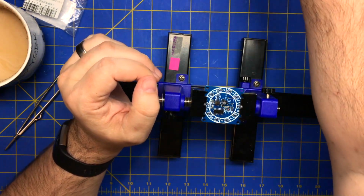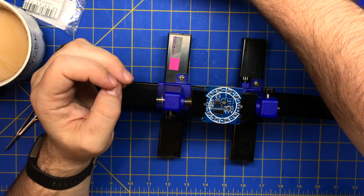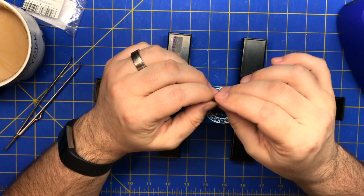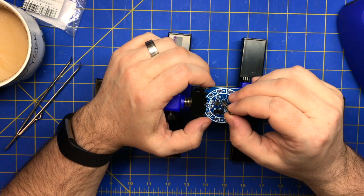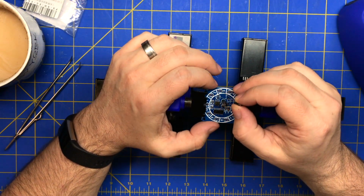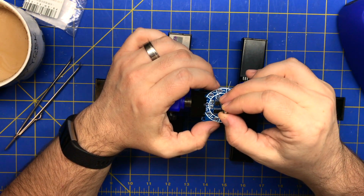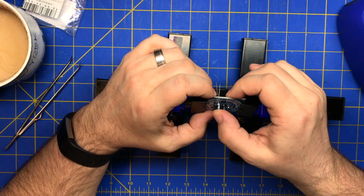Oh, that's not a capacitor. Where did the other capacitor go? There it is. This is a 1 microfarad. Again, short leg, negative, positive on the silk screen. Usually it'll say positive, or one side will be shaded. That's the band part. Positive, negative. Double check, make sure you're right.